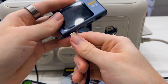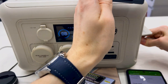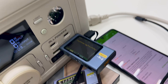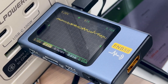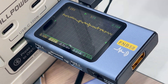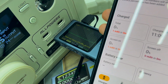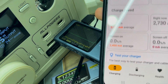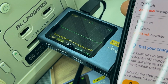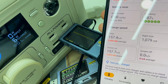We saw that the USB signal quality was similar with and without AC input. Now let's test the USB-A output. With the AC disconnected, this is the signal — around one hundredth of a volt difference, so a little bit of noise. After connecting the phone, it is charging with quite stable fast charging.